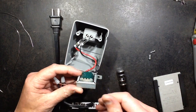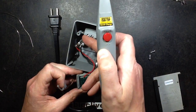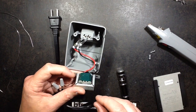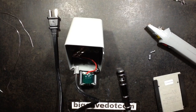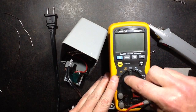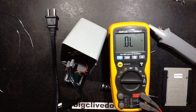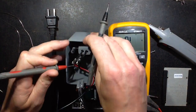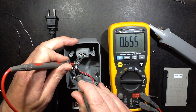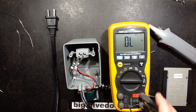But MD, who's got the savvy about electronics and so on, will now be saying, well, but it's DC, because that's basically the battery contacts that you're going to there. So this transformer must have maybe a diode in it, and if you measure it, if you use the tester set to diode, set to measure forward voltage, and you stick it across the contacts in one direction, you don't get anything. Stick it across the other, and you see one diode junction. It's just basically got a silicon diode in series, so ultra simple circuitry.